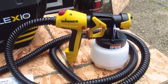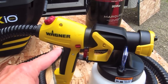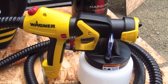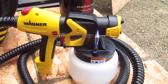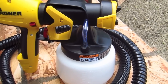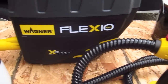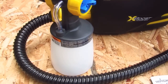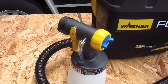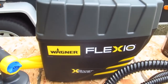Here you have the sprayer — this is the nozzle portion right here, and this is the handle. It disconnects and unscrews really easily, and it comes with two different nozzles. This wider one is for exterior work, maybe walls and ceilings inside a house. And if you wanted to spray paint some doors, trim, or maybe some deck railing, here's a fine nozzle that produces a much smaller spray pattern.